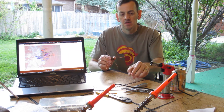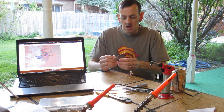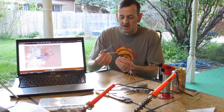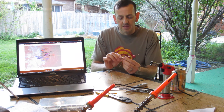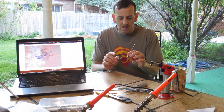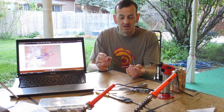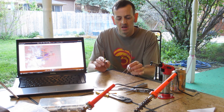So today I showed you how to make two different quarter wave antennas for 1090 megahertz for ADS-B airplane tracking. This one — the SO-239 — I showed you how not to solder, or at least how not to solder like me, because that was pretty bad. But anyway, it got done. It's fairly sturdy and it'd be fine to go up on an antenna stand out there in the weather. This one here — a lot lighter weight, with a thicker element up top — uses the F connector. The radials are 20 gauge wire, so it's a lot less sturdy. If you do want to put it outside, expect these to get bent, or you could put it inside some kind of a plastic radome to protect it from the elements. Either way, they're two good little antennas to start experimenting with using your RTL-SDR or other ADS-B receiver for airplane tracking.